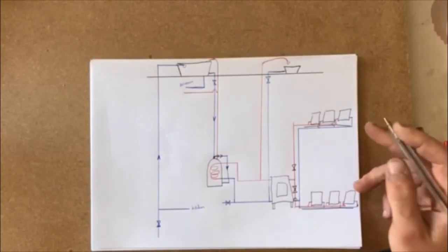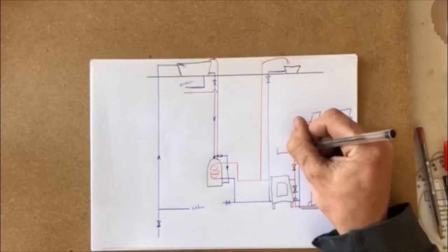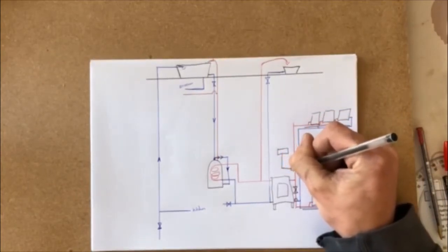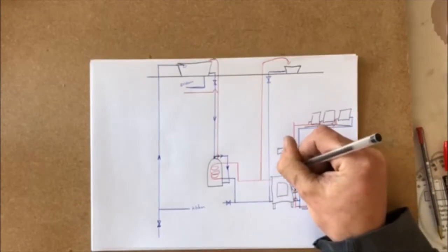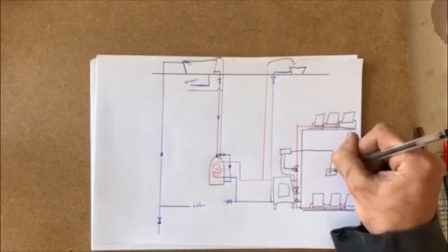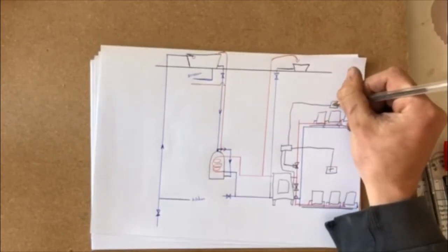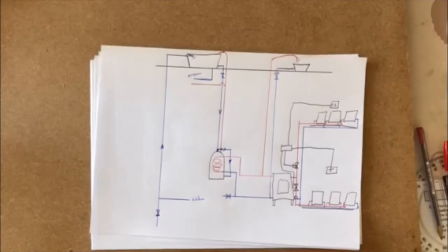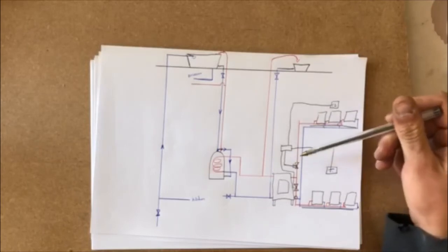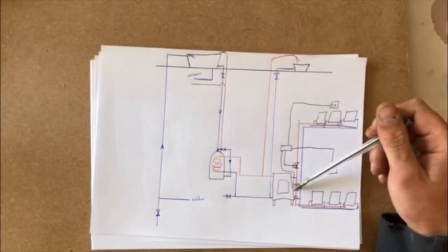Okay. Now, the other thing we have there is we can have a digital box here, okay, that runs down into these stop valves. Okay, and they come back to thermostats. Okay, thermostat 1, thermostat 2. Okay, so what that does is I can control the heat. So I can set this thermostat to 20 degrees. If it gets too hot, this box here can shut them off. Okay, that's the water into my hot and cold. Stop valves there and there.